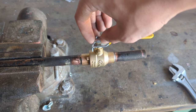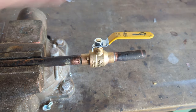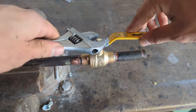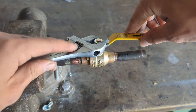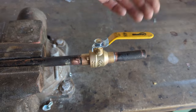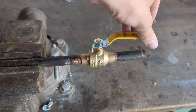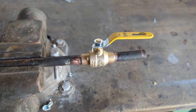This valve is kind of cheap and the threads are not very easy to get aligned, but just tighten up that nut and this valve is good to go. Also, you may have seen in stores there are both brass and bronze ball valves. This procedure works for both of them, but bronze valves are higher quality because bronze resists corrosion better than brass. They do cost a bit more. The cheap brass ones like this one are good for lighter duty projects like above ground indoor plumbing. I hope you guys enjoyed this video — don't forget to like and subscribe if you did, and see you all next time.